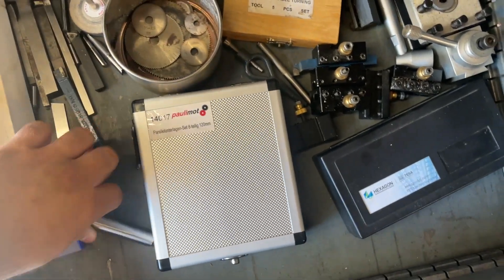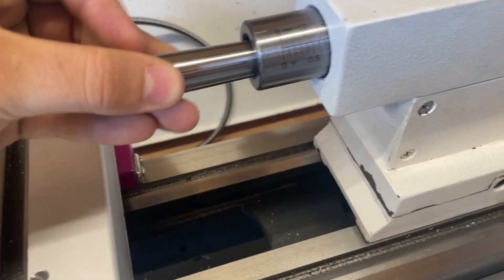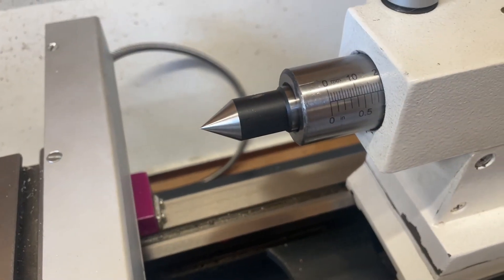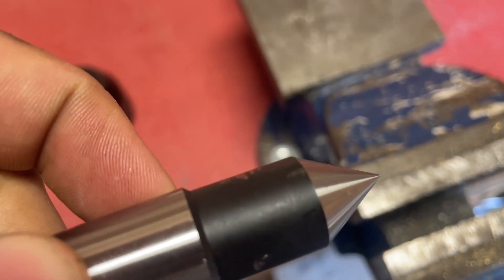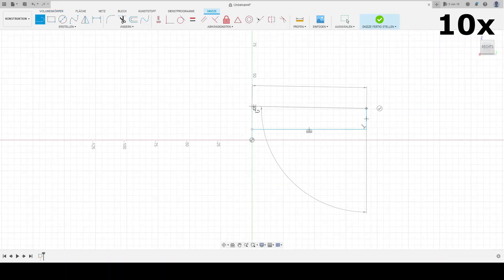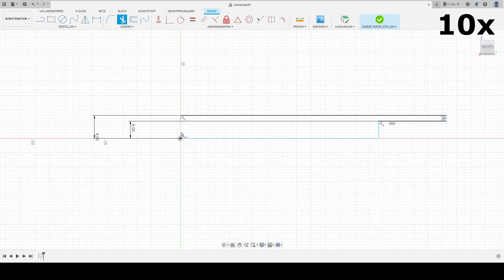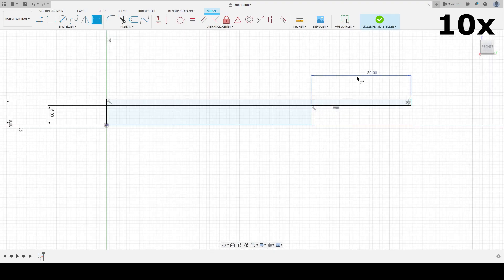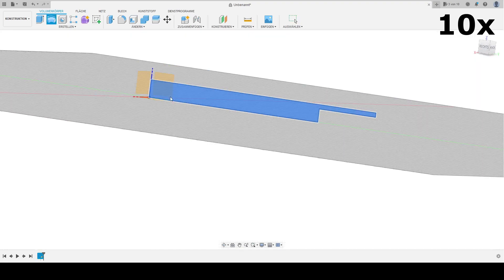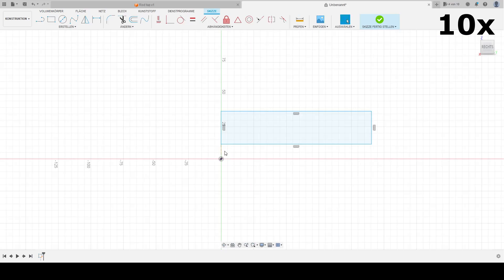This cheap center came with the lathe, and I checked if it was hardened. If it isn't hardened, I can cut into it with a hacksaw. So I will be able to turn down the back diameter and then press a piece of rod that I drilled out onto it, which I can then use as the guide rod. Now that we've figured out what this device will need to do, I can start designing it in my CAD program.